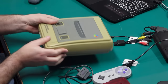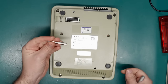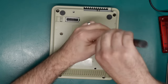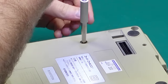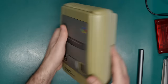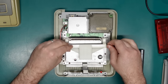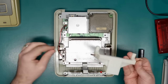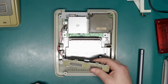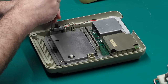Anyway, let's open this thing up and take a look inside. To get inside a Super Nintendo you will need a 4.5mm game bit driver, and there are six screws on the bottom that hold this thing together. With all those screws removed the top cover should just lift off, and then we can start pulling out the cartridge eject mechanism — it should just slide out of there. Don't forget the little spring on the end, and then we've got a whole bunch of Phillips head screws to remove and this little board at the front which should just pull out.